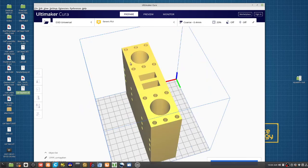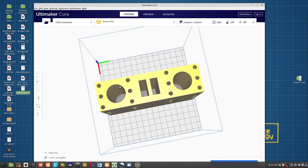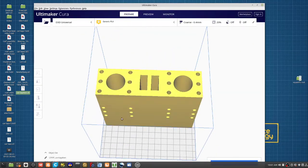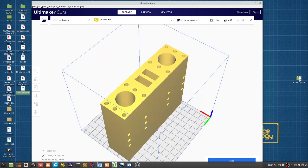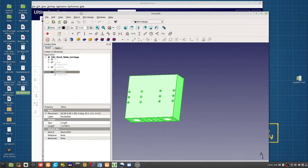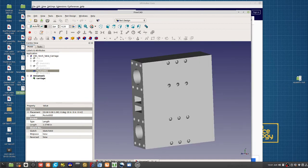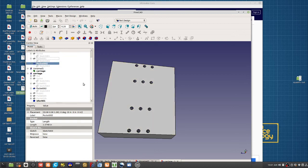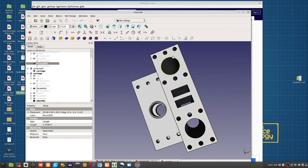Ken, you notice that you don't have the bearing holes in here, right? So this is in progress. The bearing spacer, the bearing. This is 1-inch rod, right? So you're in process still? Yeah. So the holes would actually have to be bigger than 1-inch to accommodate the bearing. Then that throws off the attachment holes, maybe. No, it's okay. It's still okay. I just did this here. You can work with it.